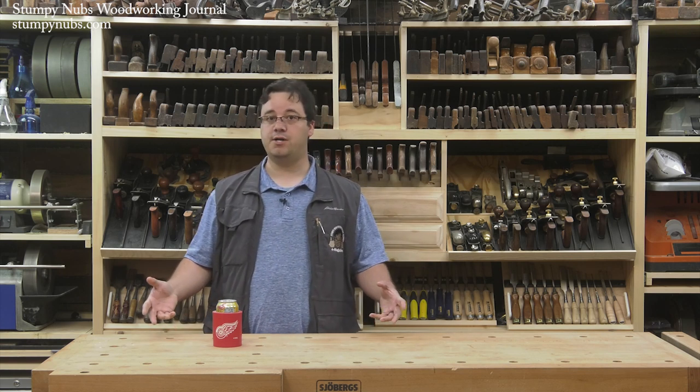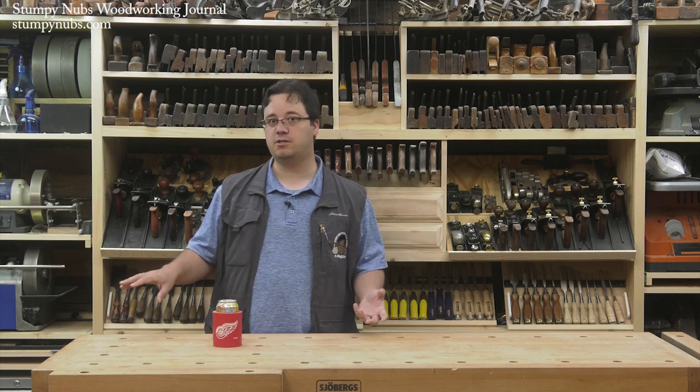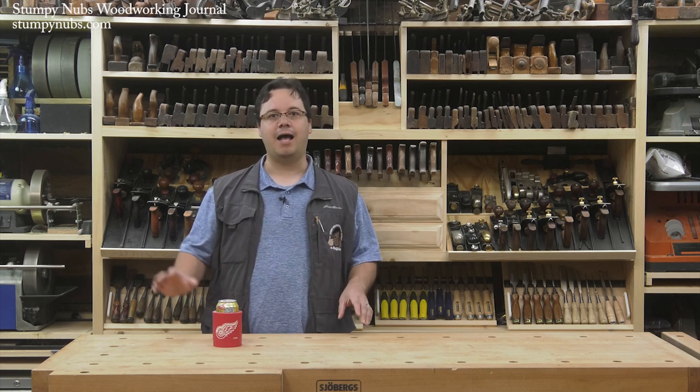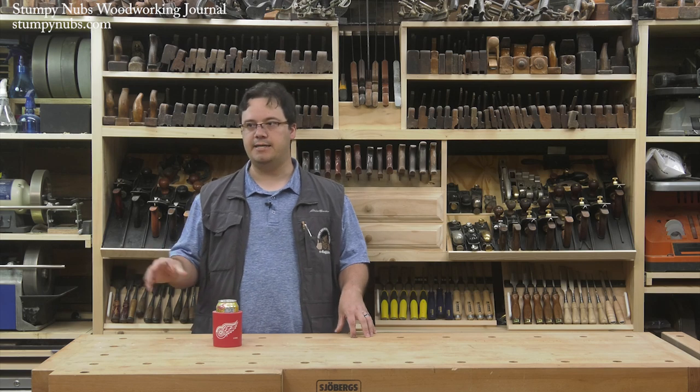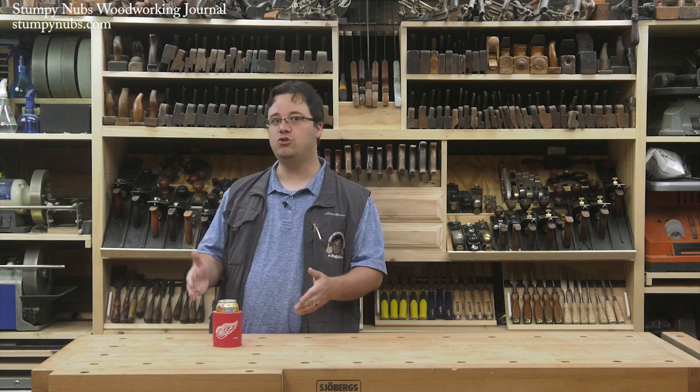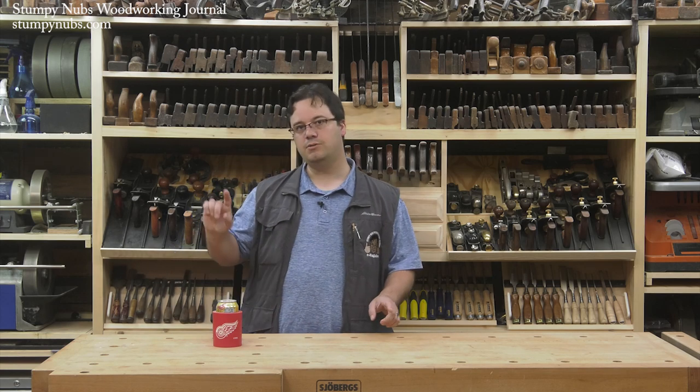And if you're working on a large project that will require a lot of wood, some dealers might charge a premium for extracting all the best boards from their stack and leaving them with just culls. I once got charged an extra 40% for the right to select my own boards — cost me several hundred dollars extra. I recommend asking first so you're not surprised when it comes time to pay. Many times though, we buy wood without a specific project in mind. For example, I got a good deal on a bunch of hickory a few years back. I just bought what they had and didn't have a project in mind, but now I want to turn it into some furniture. Since I bought it as a single lot rather than individual boards, I have a mix of lengths and widths and qualities, and now I have to find the most efficient way to use each board or else I might not have enough for my project. So let's go outside and I'll give you some real-world tips on how to turn rough lumber into project parts.